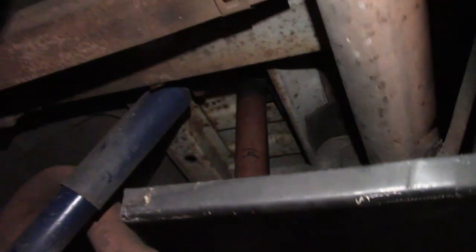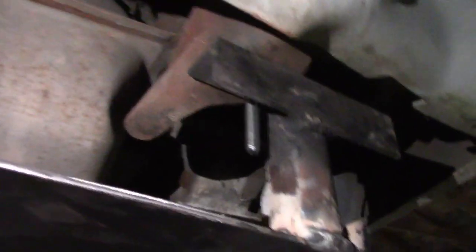Covering up the whole gas tank now. We've got mounts here, and that round tubing right there is the rear mounts — those just go through the floor. Justin's putting the last one on right now. We added a brace right here just to help keep stuff out. Got the gas tank skid plate all done, everything bolted up in there. You can see the mount just goes through the floor there, and the back is on the bumper support — so gas tank skid plate and engine and transmission skid plate are all done.